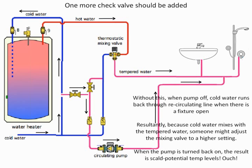Okay. The first one on a recirc line is, if you were to add recirc lines, will that increase the possibility of accelerated corrosion in the whole plumbing? Yes, it will. We tend to use a lot of copper tube in commercial construction still. On a recirc line, if that pump is oversized or the line is improperly sized, it will increase the erosion corrosion in the piping system.